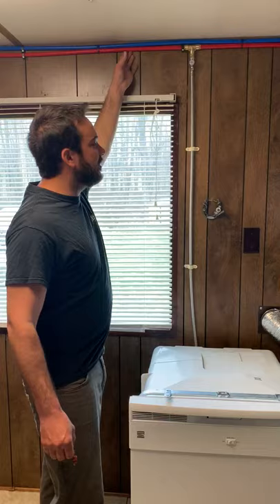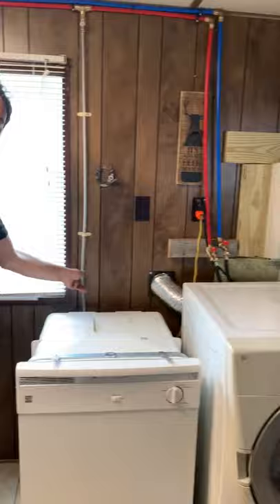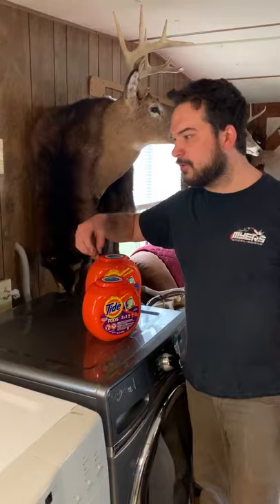Basically we got our feed line. We have these convenient lines here running to our washer and dryer, which we didn't install before. Stainless line coming in — we hook it to the bottom. Throw two lag screws down into the floor, and then we got our dump tube coming in over here. We penetrated the wall with a hole and obviously it goes out to the septic and hooks in and everything like that.